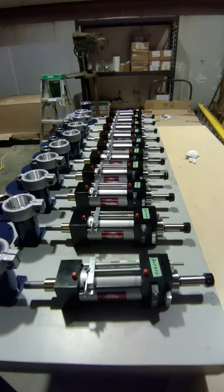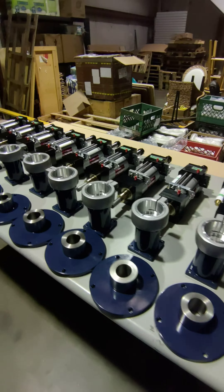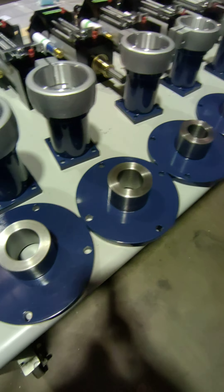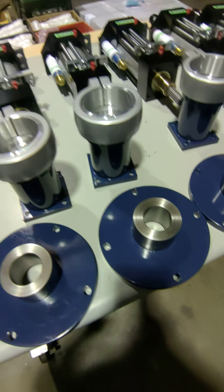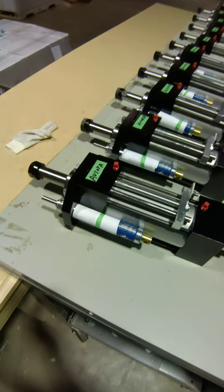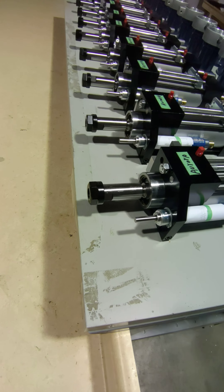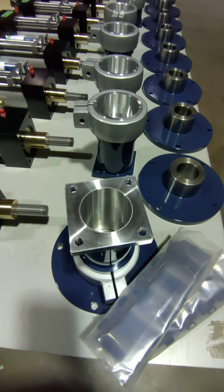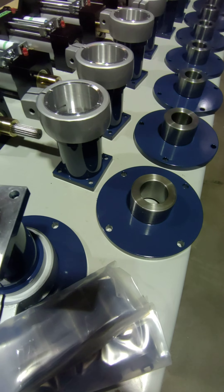What in the world is this? It's a whole bunch of auto drills being laid out for something — I see an auto drill video coming soon. We've got some adapters; these look like they're for 56C face motors. To me this looks like a self-stroking auto drill with an ER20 collet, a feed control, and a direct drive one-to-one ratio adapter for a 56C face motor.